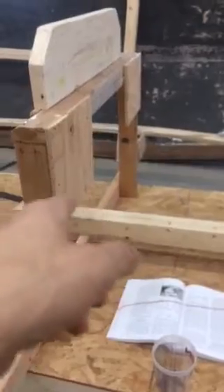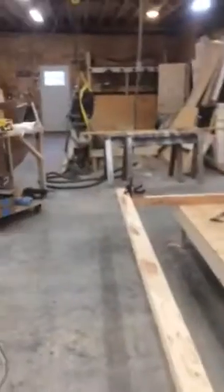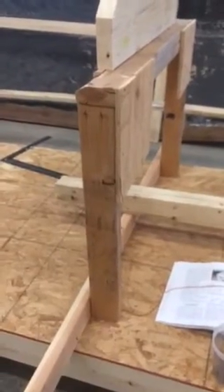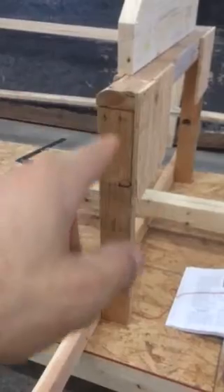Put the next jig, then put up your buck — the horse to hold your stringers. My stringers are already in the back, they're laying back there. That needs to be 28 and 3 eighths from the top to the top of the jig. The top of the jig is my OSB, so it's 28 and 3 eighths. I put a chalk line there and a chalk line there.